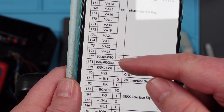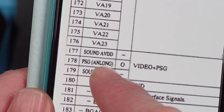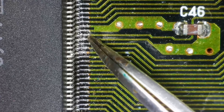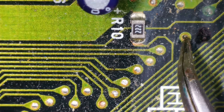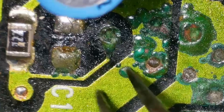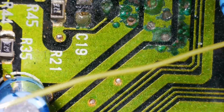This area here - 177, 178, 179 is on the other side of the ASIC. We've got two sounds, one of them is a ground. And we've got this one in the middle which is PSG - pin 178 of the ASIC. 177 is this one here, 179 is this one which is ground, and 178 is this one here. It goes round and round to this via here. From this via, it travels all the way over here to this area, specifically this via here. I've checked it on my donor board and it does indeed travel there, then into this resistor, and ends up here at this capacitor. On this board, the faulty board is not doing that - and I'm guessing that is because of this. So I'm going to clean this up.